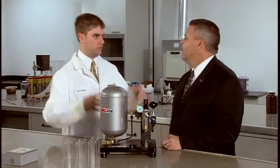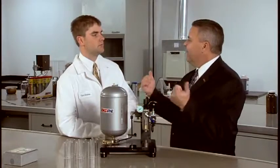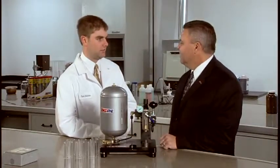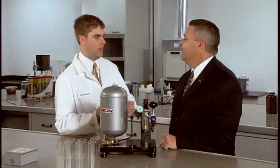That whole load forces inferior greases out that cannot cling to themselves or to metal components. So once that pound out occurs, there's nothing there to lubricate those pieces of equipment. That's exactly right. You have metal on metal contact, and even worse, once that grease is gone, there's no seal on the outside really to keep that water and contaminant ingress from occurring and causing extensive wear.